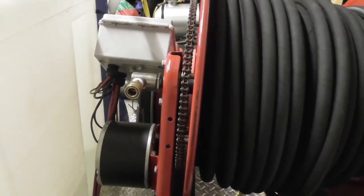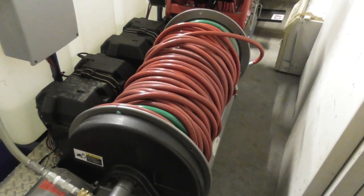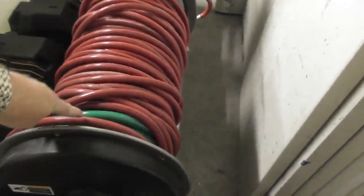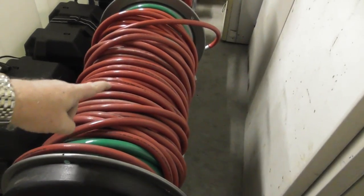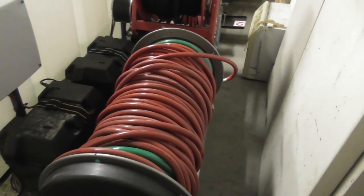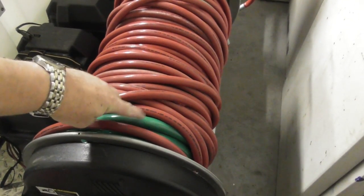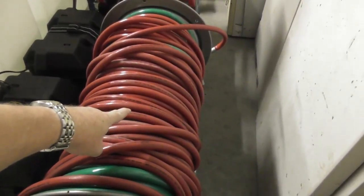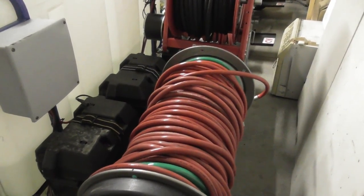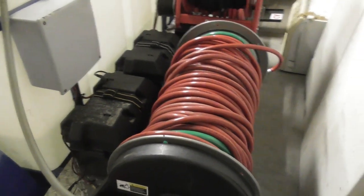If you look right there, I put a quick connect there. The reason is on the back of this trailer there are three reels, and this is the lead hose coming off the pressure washer. Right now it's connected to this gigantic reel that holds about 300 foot — that's my drain cleaning reel. I have a half-inch hose in here, 150 feet, that goes to the house. But when I roll out this 3/8 hose for drain cleaning, it'll connect to a foot pedal so that's what actually goes in the drain. I coil that up, carry it to the drain if it's in a house, hook it to the foot pedal, then keep this clean hose going through the house — because you don't want to drag a nasty hose through their house. So this quick connect: if I'm not drain cleaning, I can disconnect it and hook it up to that hose and do pressure washing.